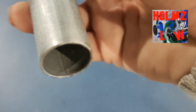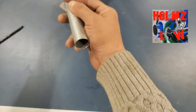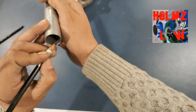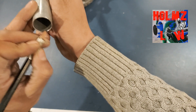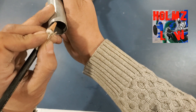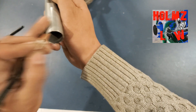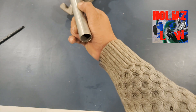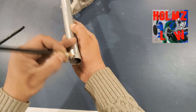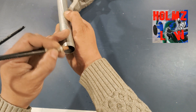What I like to do is I'll take a marker — I only have a pencil today — and I'll mark that seam on the edge of the conduit, just on this little lip right there. And then I'll go ahead and by eye, as best as possible, I'll line it right up and put it right on that top lip there as well. Then you want to go ahead and transfer that over to the top of your conduit. You should have a line going straight through to the lip of this conduit.